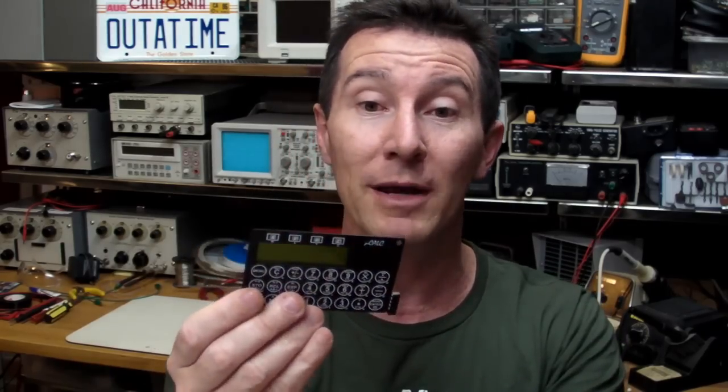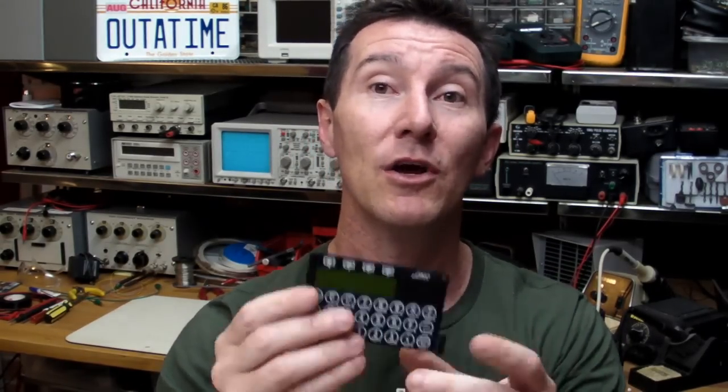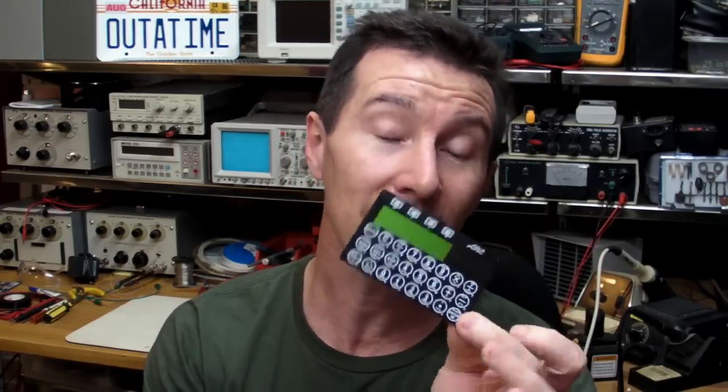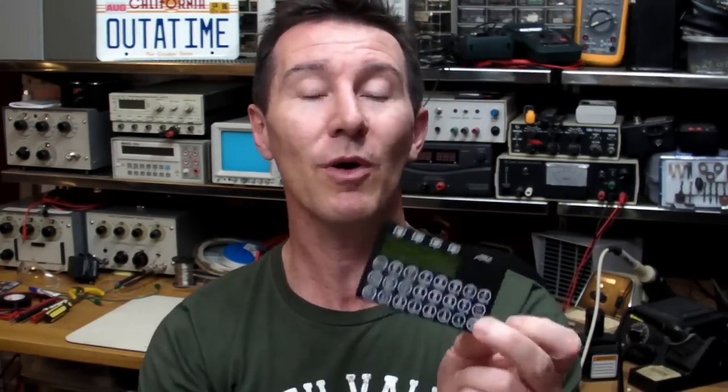That was the microcontroller choice — a little bit arbitrary, a little bit of thought, but plenty of power. It needed to handle not only the dot matrix LCD display but the microSD card as well. One of the other major design aspects was how to power it. I originally wanted to solar power it, but I've already done a blog on why that's not actually possible here. So I decided to use standard lithium coin cell batteries, because I wanted them to be replaceable. I didn't want rechargeable — they're a pain. The battery life calculations seemed quite reasonable.